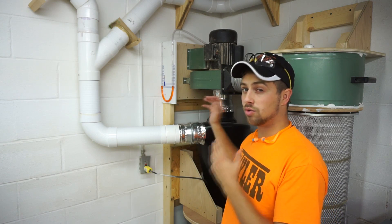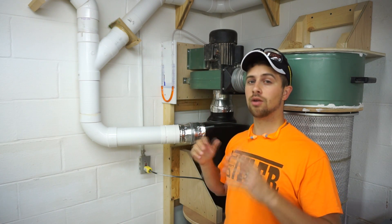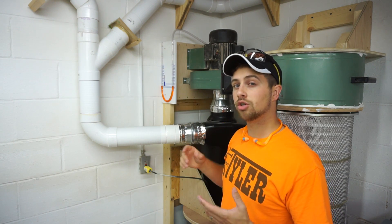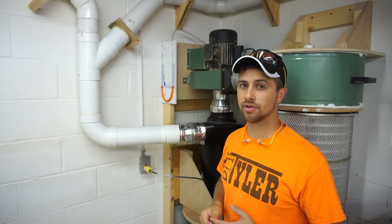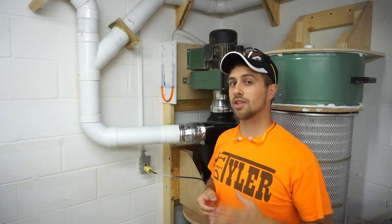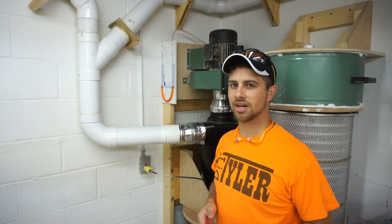So there you go guys — a real-time filter monitor that will save your lungs and hopefully save your filter in the long run. This thing only costs a couple bucks to build and it will take you an evening to put together and you'll absolutely love it. I put a little graph on mine with colors so I know when I'm getting into the red, but really you should only have about an inch of water level rising before it's ready to clean your filter. If you'd like to know more about these filters you can watch a video I've linked right here. Please hammer that thumbs up button if you enjoyed this episode and please subscribe — I'm DIY Tyler, you guys have a good one.